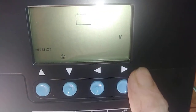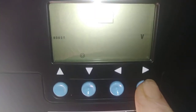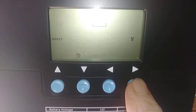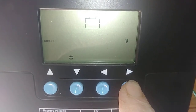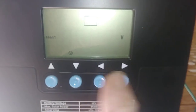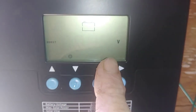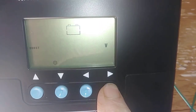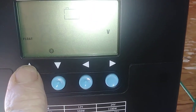I'm not going to change that because it's already set up. We're going to hit enter again, and what you're going to see now is the boost. Whatever your manufacturer of your battery says that parameter should be, that's what you're going to set it at. Again, use the down and up arrows to change that parameter. Once you've got it there, you hit enter.